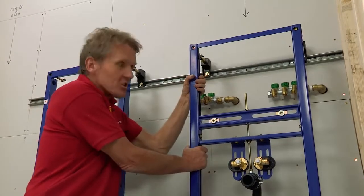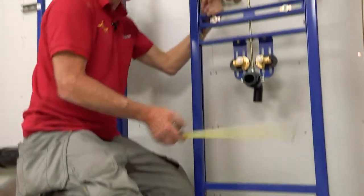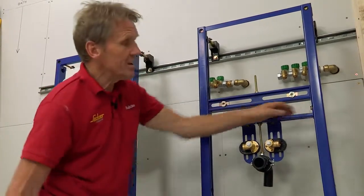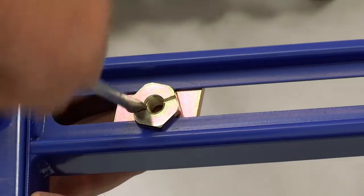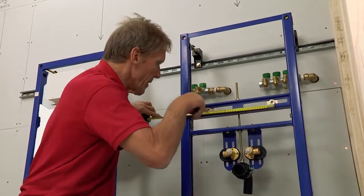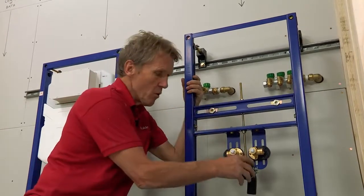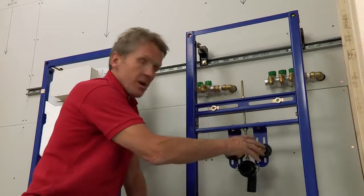Now I've got the frame securely fixed, there's still adjustment here. From my finished floor level — elements board plus tiles plus adhesive — I want to achieve 850mm to the top of the basin. That gives me 795mm to the centre of the bolts. All that can be adjusted on the socket up or down. With this particular basin I need to adjust out to a 280mm setting. I can also do a trial fit — I'd recommend that at this stage — put the basin up, check where your trap and waste are going to go, since you've got rise and fall plus in-and-out adjustment on the pipe connections.